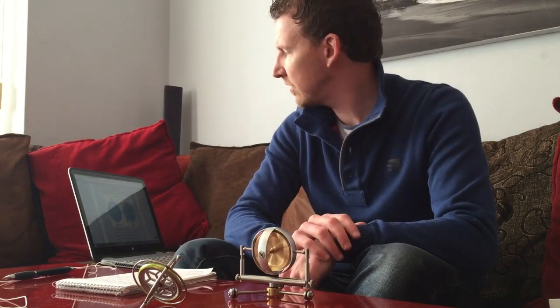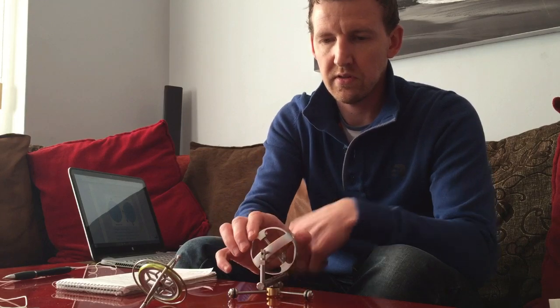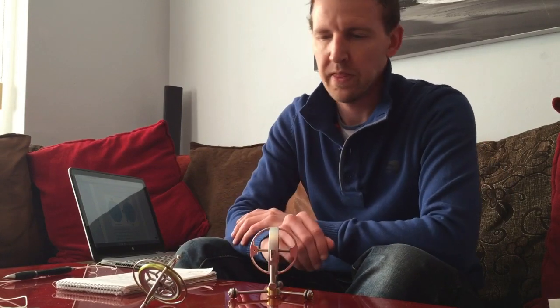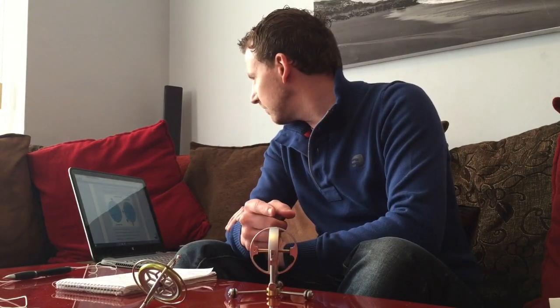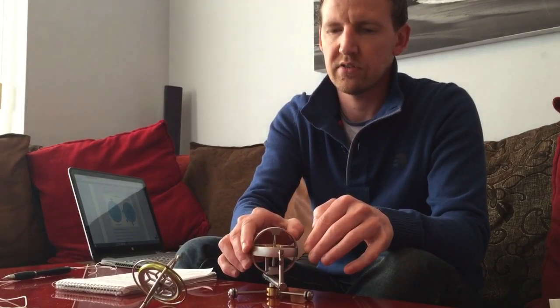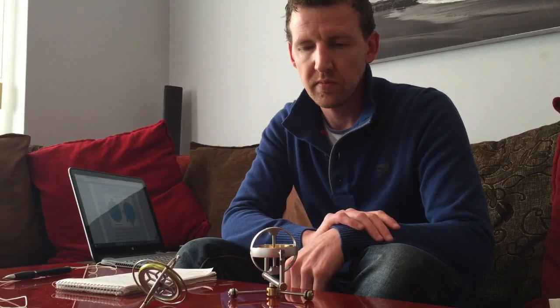It's still going. All they say is that the drift is dependent upon whether the gyro is vertically aligned or horizontally aligned — that refers to the spin axis of the gyro. If the spin axis is horizontal, the calculation is 15 times the sine of the latitude in degrees per hour. And if it's vertical, it's 15 times the cosine of the latitude in degrees per hour. It doesn't mention anything about the particular compass direction.